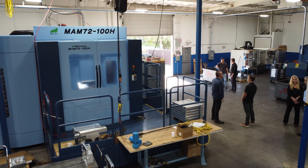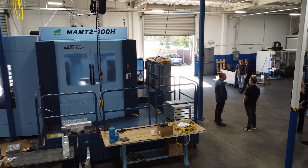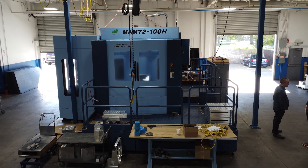The way the machine is built to monitor — even the temperature of the coolant, the hydraulic fluid temperature, collecting all the mist out of the machine — it's really built for 24-hour service. A lot of people are trying to make regular machining centers into automated machining centers. It can be done, but it's a challenge. They don't hold enough fluid, they don't have the temperature sensors in the castings. It's nice to have a machine that's really built to run 24 hours.